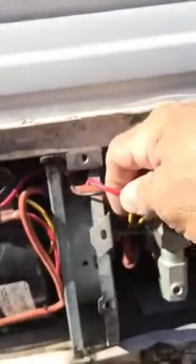One problem I had when I took this out before — this is my second time — is the nut for the gas kind of gets in the way, so stick a screwdriver in there and pry it off to the side while you're pulling it out. Now this orange wire here goes to your igniter. Before you get too far in, disconnect a couple of wires: take the red one off of here, and then disconnect the igniter wire itself.